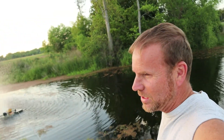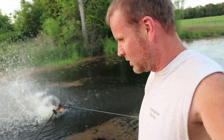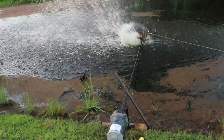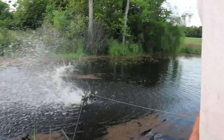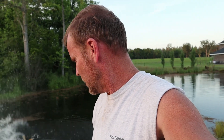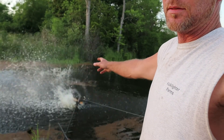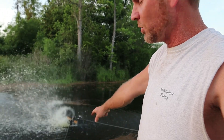The aerator ain't working too good. I done had to change the motors. I had another motor sitting in the chicken house, swapped it out. That's a used motor I had. And I also took half the paddles off. The last motor kept getting hot and tripping out — reset it two or three times. I got to go back to the drawing board. I like the thing, but it's only going to aerate half as much with half the paddles. I think it makes a shorter shaft.